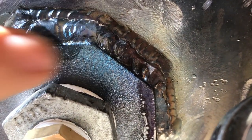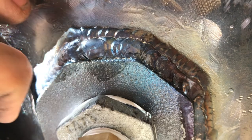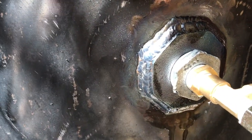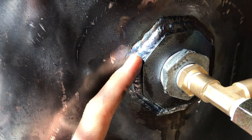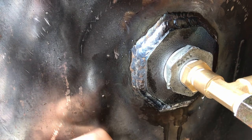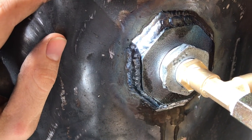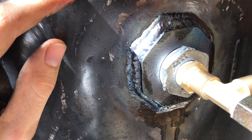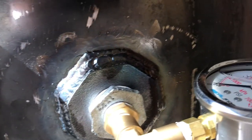This is probably the biggest problem and mistake I made. I used cast iron fittings and it turns out they're not weldable — they just don't really mix. Being able to weld them to the steel didn't work no matter what I did, whether I was preheating or trying other things. They kept leaking water even without pressure. I think you can use galvanized; I've used galvanized on other projects with no trouble, but I was trying to save money. I ended up using 304 stainless, which worked out perfectly well.